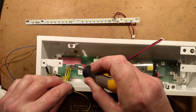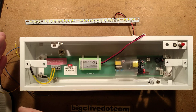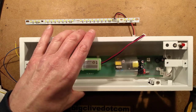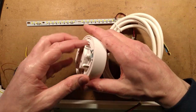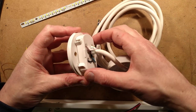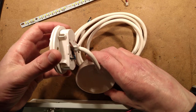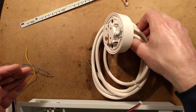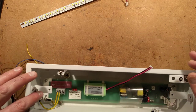Anybody who is a bit old school in the electrical industry will recall the annoyance when fitting emergency lights — trying to run a cable and loop it through, and the connectors were never big enough. But these days, with a proper modern installation, we'll have ceiling roses mounted onto the ceiling or a wall or trunking. You can take the cover off and physically unclip them, which means unskilled operatives can do maintenance by changing units out, and skilled operatives don't have to risk inconveniencing anyone by turning the power off to the whole place.